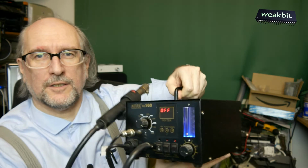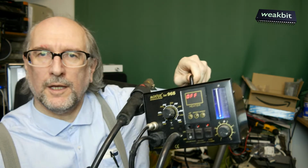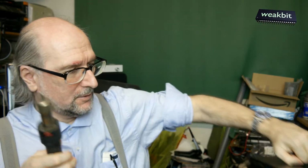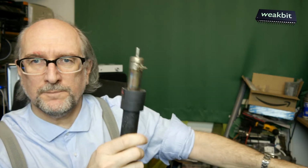Further, I would like to tell you that in this CD player we must uninstall the DAC, and this IC, integrated circuit, is here on the motherboard. I use a hot air machine like this, and with this hot air we can desolder the chip, and that is what we are going to do.